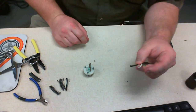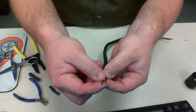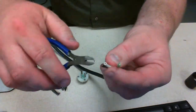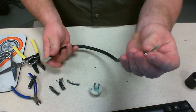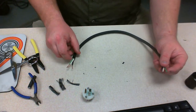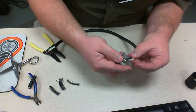Do you clip off — do you make the ground wire longer before you strip off the ends? That's a good point. Actually I've done that with this. His point was — and thank you for reminding me — that these cables do need to be slightly longer. The ground wire does need to be slightly longer; it is approximately an eighth of an inch longer than the other two. You simply start right here, move it back an eighth of an inch, and snip those two so that you've got that wire length. There are times you need to worry about perfect, but that isn't necessarily one where you have to obsess about exactly an eighth of an inch — but generally, that ground wire needs to be a little longer.